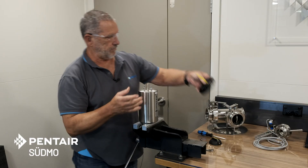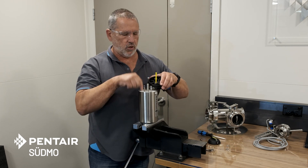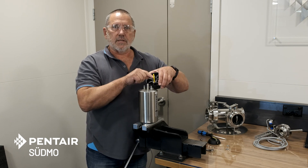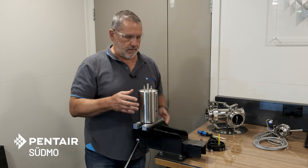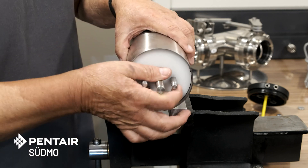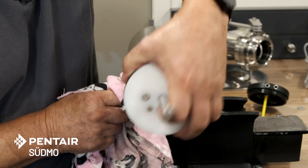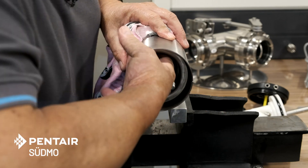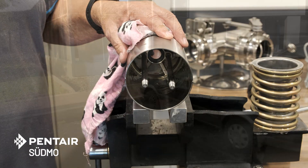These washers and keepers will fall out. Here we have the unique device that allows us to feed the air in through the top and down into the bottom of the actuator. Just be aware you should only use the yellow hose that comes in the kit for this — the black tubing is not good enough. And those are the internals. We can now pull it out, remove the piston, the cage, the spring — and that is it, simple as that.